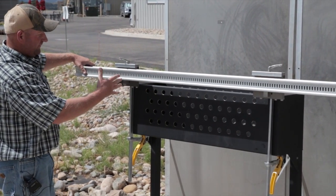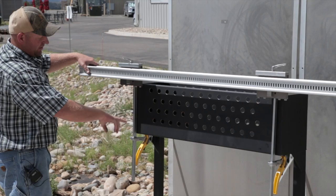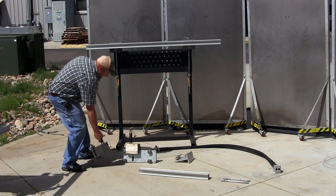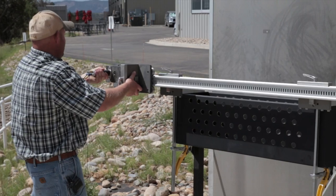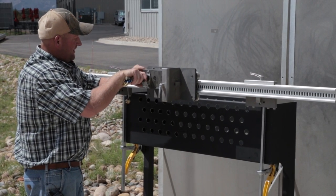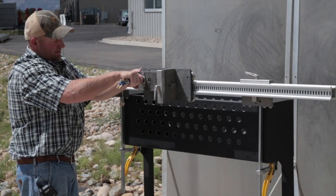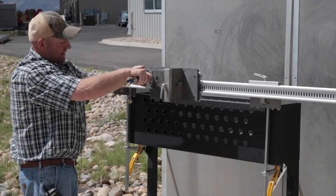If you were setting up on a real FinFan exchanger, you'd want to leave about 30 inches on this side so that the carriage has enough travel to hit the tubes on the end. Next, install the horizontal carriage — this is a standard carriage from the lightweight positioner. It has a nice feature where you can just loosen the handle, manually position the carriage where you want, then engage the slotted rail and tighten it up.